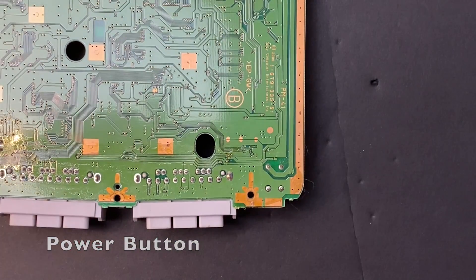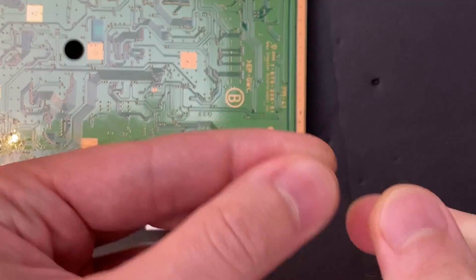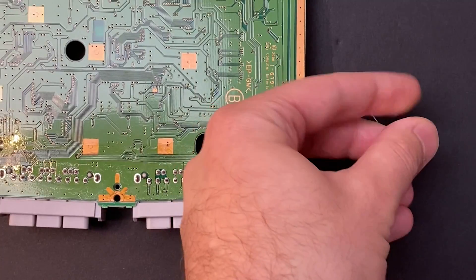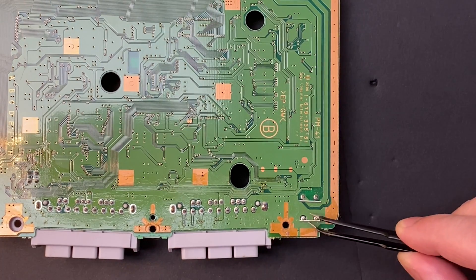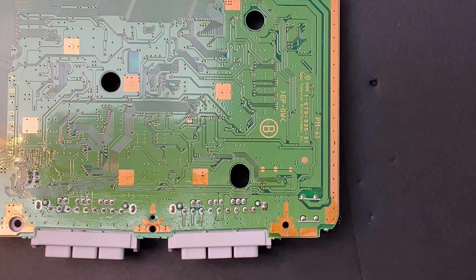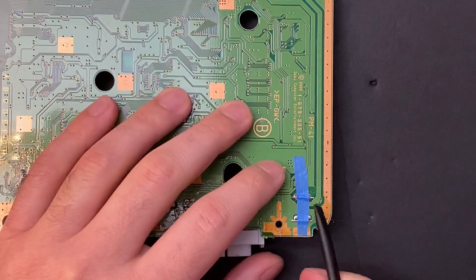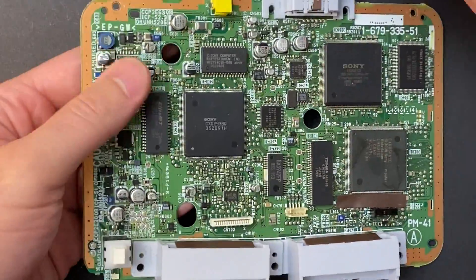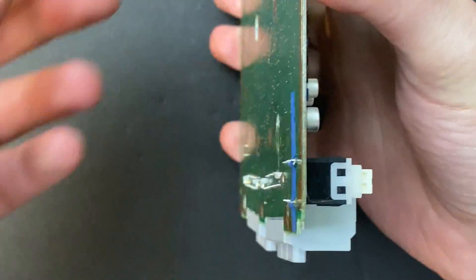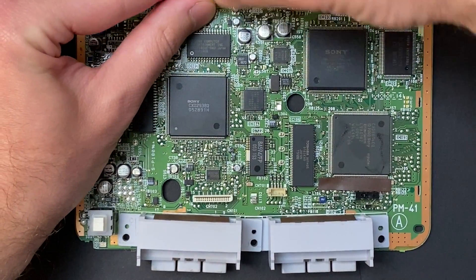Although the power button has 4 pins, it's actually 2 separate switches in one. So grab that paperclip and cut 2 pieces about half an inch long. What you want to do is short the rails horizontally to mimic the power button being pressed. A little bit of masking tape should be plenty enough to hold it in place for testing. So plug your power adapter in, and if your console turns on, that means your power button's faulty. These power buttons are flimsy, so I don't want to open mine up in this demonstration. But if you do want to try rebuilding yours, I cover that repair in an earlier PlayStation video linked in the description.